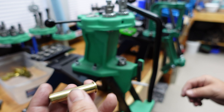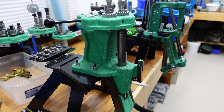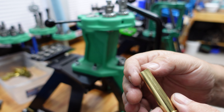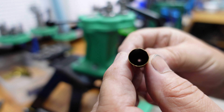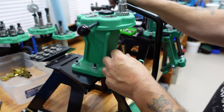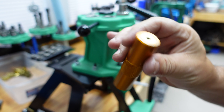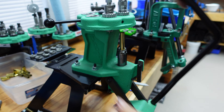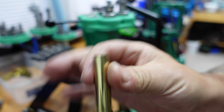It's a good way to check too — as you're picking the brass up and handling it, just turn it in your hand and check it. You can never do too many checks — you never know if there's going to be any splits or dings. Just go through, check it all, make sure it's good. If you're happy with it, put it in the tray. That one's got a tiny little offset thing on the top but the die will soon sort that out. See, it goes in the case gauge perfect, nice and level, drops straight out with no resistance. Take it around, flare it. I like to check every single one. That's perfect — next one done.